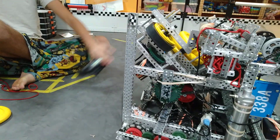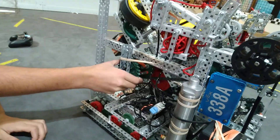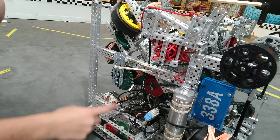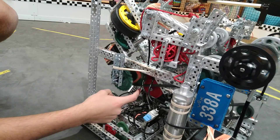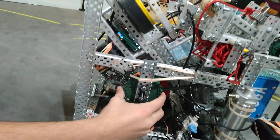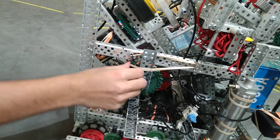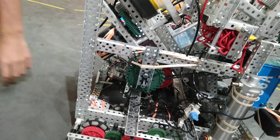Our indexer is actually the most unique part of the robot. It is a ratchet piece and it has two ratchets. The first one actually drives this system — so when the intake is going forward, this whole system doesn't move, but when it goes backwards, it drives our linear puncher. Then this second ratchet keeps it from going backwards, because otherwise when you intake, the system moves, and that's a big no-no because then you've just indexed a disc for no reason.